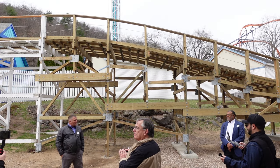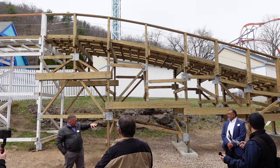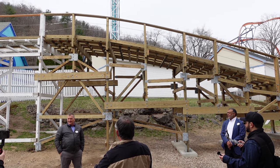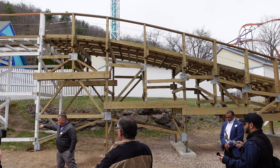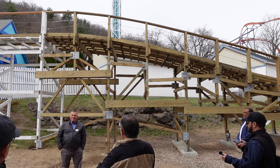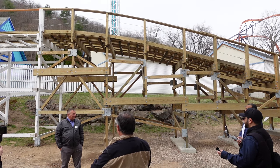And we did that. So while we did that, we had to add a lot more reinforcement in the center. So we had to dig out the whole section, pour a new pad, instead of having some of these old footings. Because some of these old footings, like here, those were poured 100 years ago, just about. They're 1926 piers. And they're still standing, they're still original.